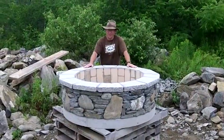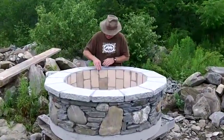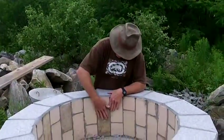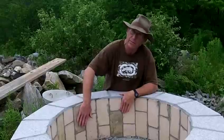Hi, it's John from Forgotten Stoneworks again. This is a completed fire pit. As you can see, the fire brick is mitered to the granite cap, and the fire brick is proud of the granite so that the flames go by the granite.